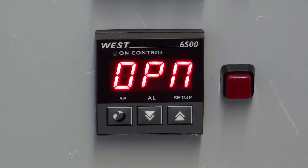The N6500 controller can be set up for type J, L, K, N, and T thermocouples and RTDs. You can choose between reverse acting or direct acting PID control, reverse acting on/off control, or direct acting on/off control. You can choose between high, low, deviation, or band alarms for the alarm type.